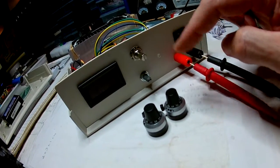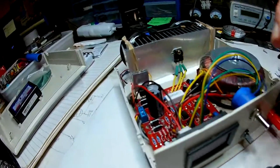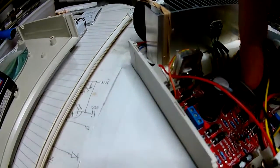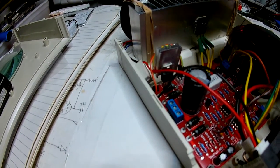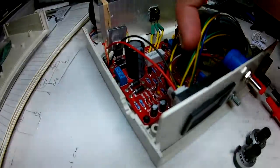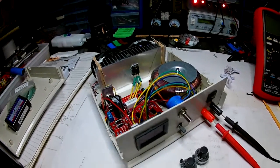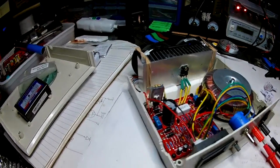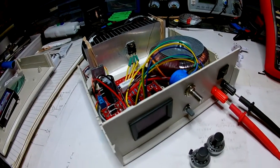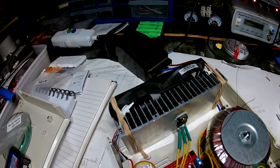I used a rounded head fitting at the back so the LED fits in there - it's a different LED, still a red one, because I'd put it on the board and rather than unsolder it, which was a pain, I just snipped it out and put this wire on instead. I've made the adjustment to calibrate it so on here we've got zero volts when it's at zero. The fans are spinning well but you can hardly hear it - there's plenty of wind coming out there.